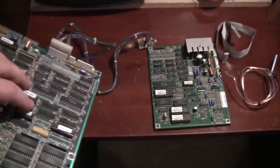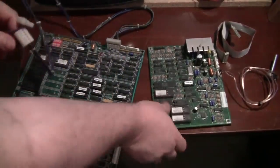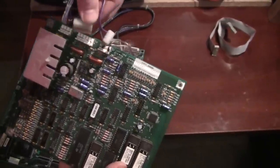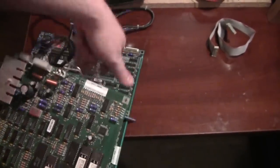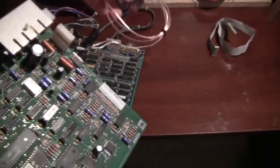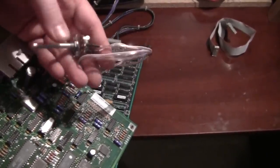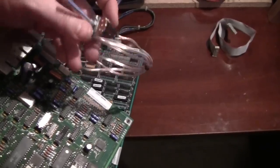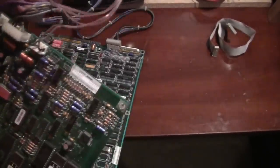The other end of the cables goes to your soundboard. You've got a connection marked P6 and a connection marked P7 — you really can't screw it up. Then you have a connection for your potentiometer. A lot of times when you have a soundboard like this it's missing the connector and you'll have to wire in your own potentiometer — one wire goes to the middle, the other to either tang depending on which direction you want to turn it up or down. It's soldered to pins two and four of P5 on the sound connector.